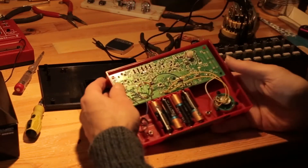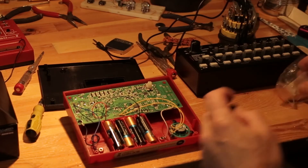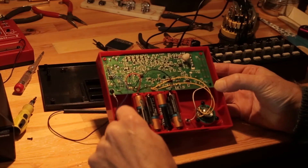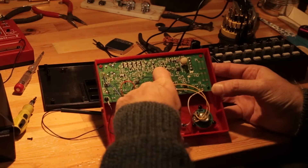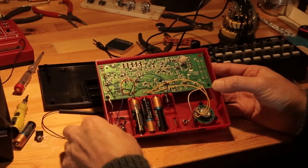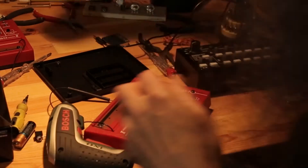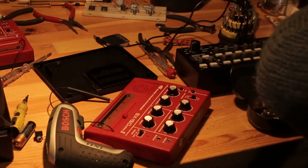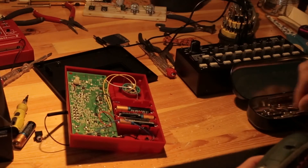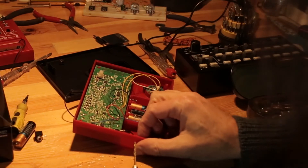This really is the easiest mod in the world. All you've got to do is fit a little socket, which you attach between this point here where the wire connects — because that just goes through there and is screwed on there. You need a good earth point, and a nice easy earth point is at this battery here. Apart from that, all you have to do is drill a hole through the side. The case actually drills really easily, although I recommend drilling a small pilot hole first, and then a bigger hole to take the actual socket. You can see you've got plenty of space in there.